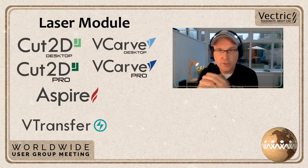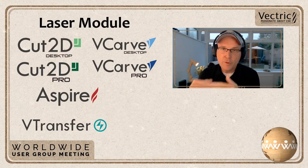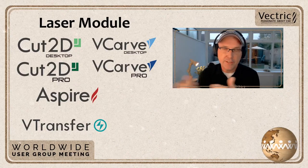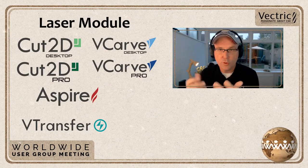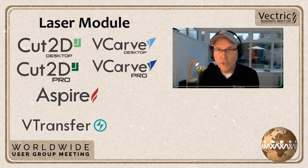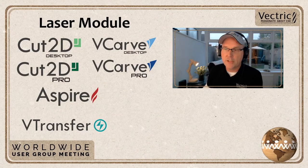Now, VTransfer comes with all of our products again, and what it's used for is to send the G-code directly from your software right onto your CNC. So if you happen to have a CNC that plugs directly into your laptop that has a Gerbil or GRBL controller, then you can use VTransfer to send your G-code right straight from the software, which is really quite powerful, and that's what I'm going to use for all three of these projects.